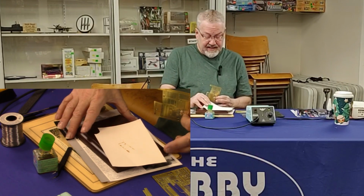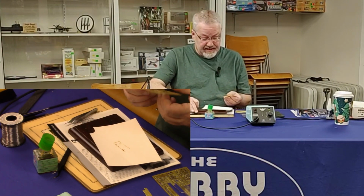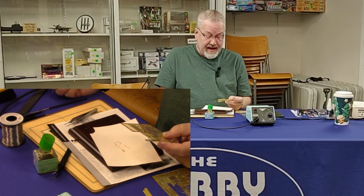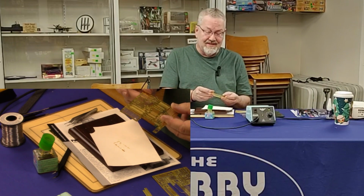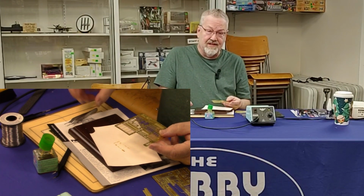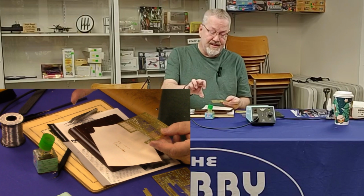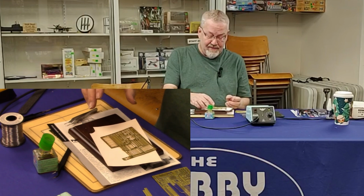Point before I forget it, and you can even see on that white paper, that's residue from the flux. You have to clean the flux because obviously you can't paint over it, and what I use for that is acetone. I did work for many years where I soldered every day doing stuff that makes this look massive. And we had an ultrasonic cleaner with 2 jars in it, just baby food jars, that we would put acetone in. We didn't put the acetone right in the ultrasonic cleaner. You know, we had a little rack we had built.